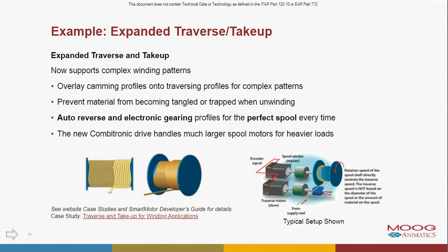We have a lot of other features within traverse and take-up winding. You can adjust left or right spool widths dynamically, gear ratios dynamically. We even have something called encoder count offset — so if you're winding something like a ribbon or tape that varies in width, you can actually detect the width and pack the edges right up on it so you have no hollow spots in the core of the wind.